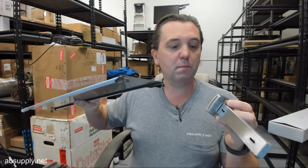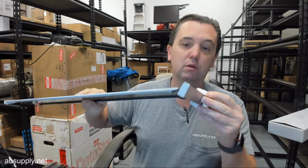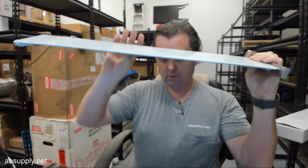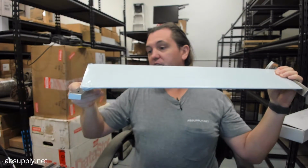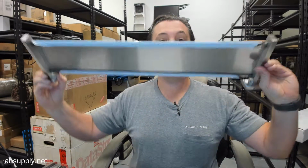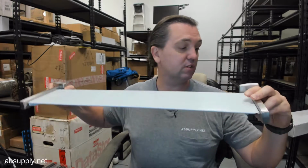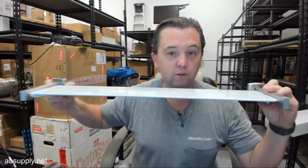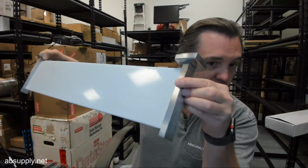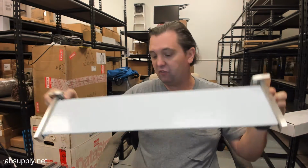You'll want to get those mounting plates mounted to the wall and then loosely assemble your shelf together, and then basically take the arms and place them up and onto the mounting plates, and then tighten your set screws. It'll just hold there until you can get those set screws tightened down, and that's the look. Obviously less the white peel away protective film that's there.